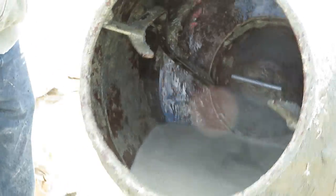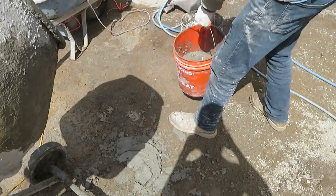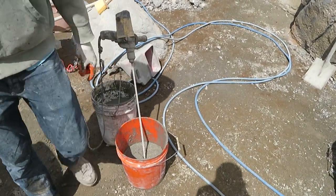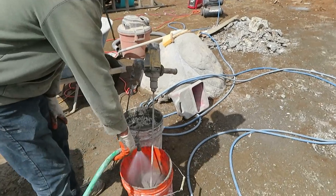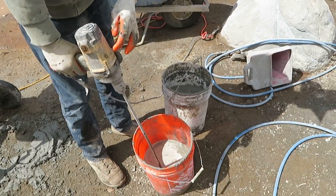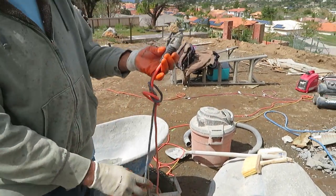I usually hook the hose on the mixer somewhere in the back so it's basically pretty stable. We've got one bag mixed. Now we want to get the drill mixer — we need a little more moisture in this thing to get it to the consistency we need for blowing through the hopper. This is a half-inch drill and you want a pretty heavy-duty drill to handle this. Daniel, can you check the plug over there? Maybe this cord that's a thousand years old has finally died.